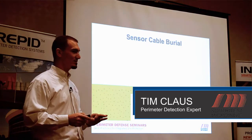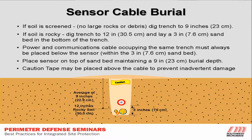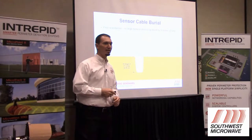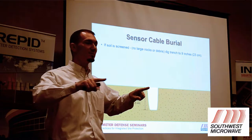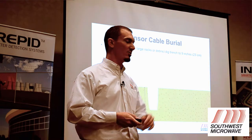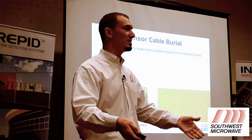When looking at the buried cable system, let's get into the technical parts. We want to trench about nine inches deep. It doesn't matter if you have a frost line, clay soil, sand, or anything like that — we go an average of nine inches and it doesn't have to be perfect. Early buried cable systems required perfectly spaced, uniform-depth trenches, but the MicroPoint or MicroTrack system isn't like that — about nine inches deep and one to two meters apart.